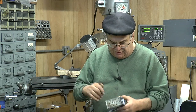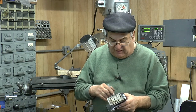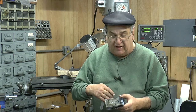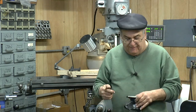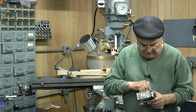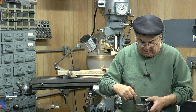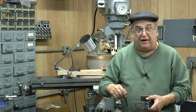I'm going to put through bolts in there. On the back side here, I'm going to machine that so it's flat. So when I put the bolts in, they're going to hit flat on the surface. Now, if I had a reverse spot facer — which goes in from the bottom and comes up — I would spot face all of those. But I'm just going to mill it down very carefully to get most of it off, and I might do it in steps, so that's not making it real thin there.